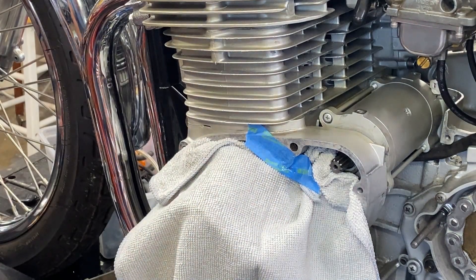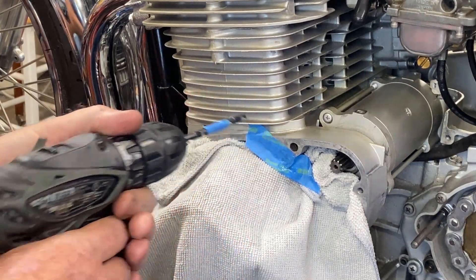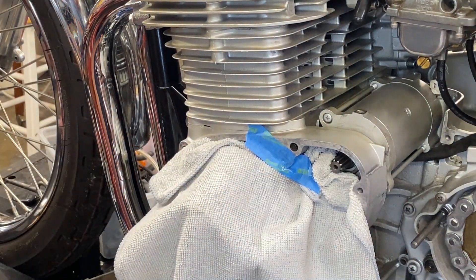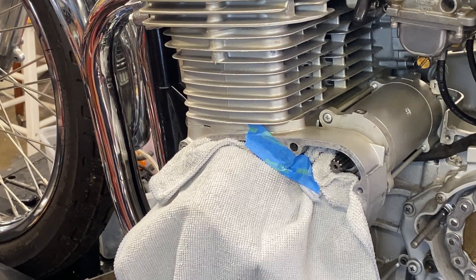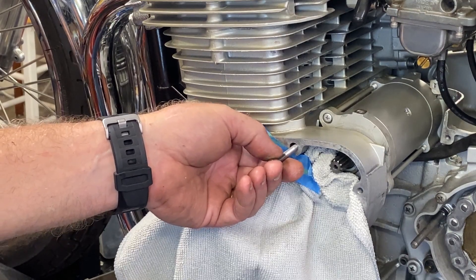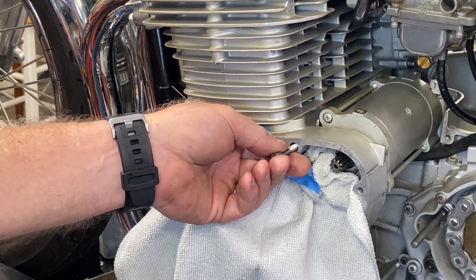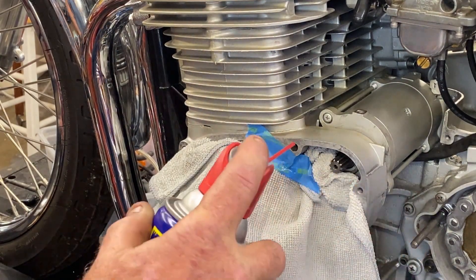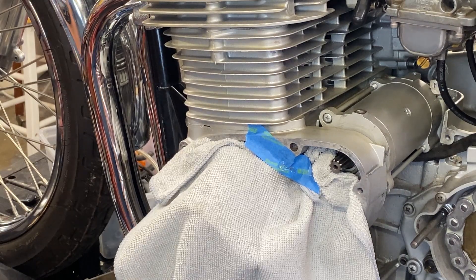This thing going in crooked is why this hole is so tricky. It's really important to get this as straight as possible, because if we're off one way or the other - number one, the threads are not going to line up to that counterbore straight, and when the knock pin goes back in, it's not going to want to let that bolt go in properly. The threads are very close tolerance to the pin, so this has to go straight - the pin will essentially be a guide for it.